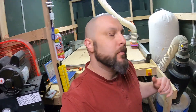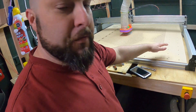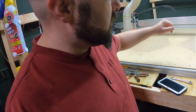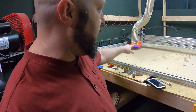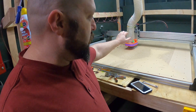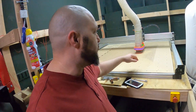I've been learning the Mach 3 system, which is pretty complicated, but once you get a hang of it, it's not that bad. Right now what I'm doing is a surfacing of the work bed, because the machine is level and the stand it's on is level, but what really matters is between your cutting head and your work board — your waste board. This needs to be level so that anything you cut is always level to the machine.